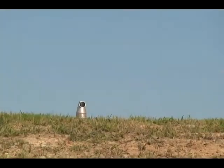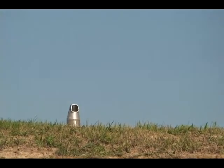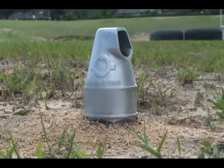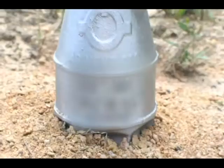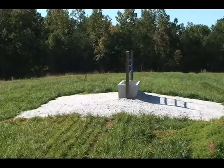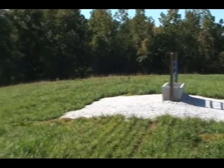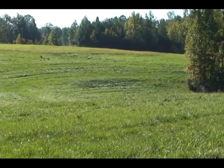You may also need to install air relief valves. They prevent air locking, which can interfere with water flow. Sometimes an air-filled pipe can even collapse. If the pipeline runs uphill from the water source to the tank, an air relief valve should be installed at the line's high point at the crest of the hill. But you can eliminate the need for air relief valves if the water trough is located on the top of a hill, so that the line runs only uphill and the air can escape through the trough itself.